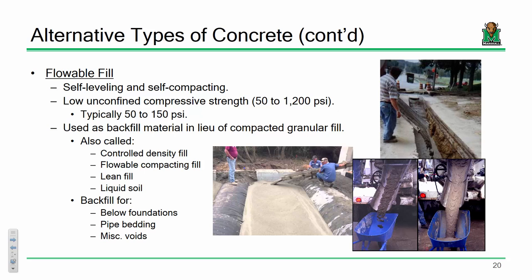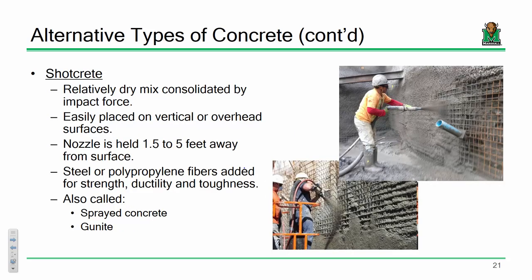Okay? It's not meant for a beam in a building or a slab in a building that's going to be subjected to significant shears and moments. That's not what it is. It's really meant for more like backfill type material behind an abutment, between some culverts, something like that. Literally just filler. So, bedding for pipes, you might find it filling areas in foundation or geotech work, but it's not meant for load demand. It's just literally filler. So just something to be aware of.